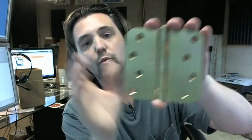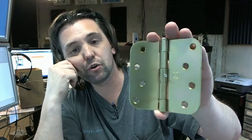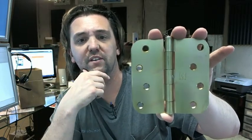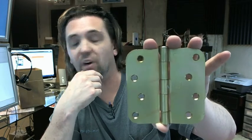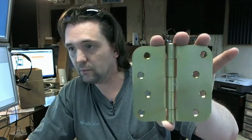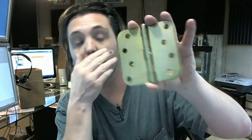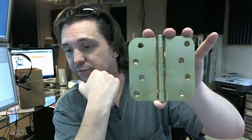This is a standard residential hinge. Why NRP for that? Well, you could have exterior residential type full glass doors — it would have a 4x4 with a 5/8" radius. Certainly an inch and 3/4 door would take 4x4 hinges. Exterior outswing would have the pin; I've even had some clients with bedroom doors that they wanted to have the security feature on for whatever reasons.